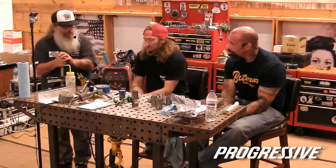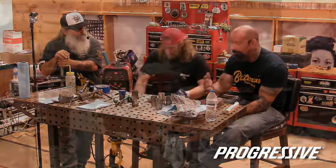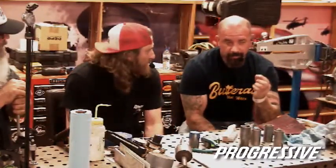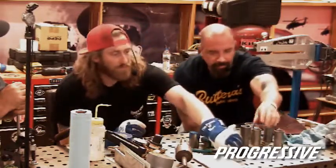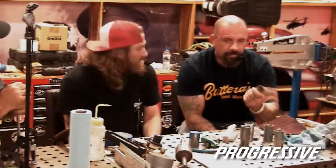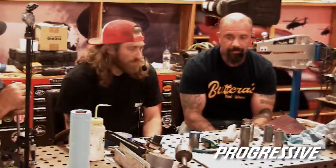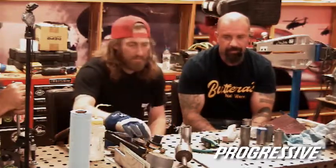And on purge welding, I always purge weld exhaust and use rod. A lot of that comes down to the wall thickness of your material too. When you get into 16 gauge, which is typically exhaust, the heat's a totally different animal than if you have a 156 top tube or something like that. Purge welding is usually seen in the thinner wall stuff.